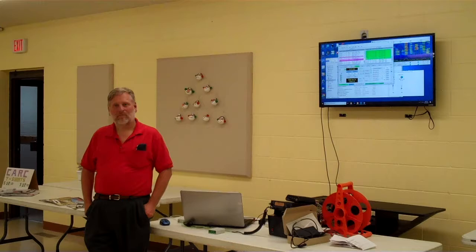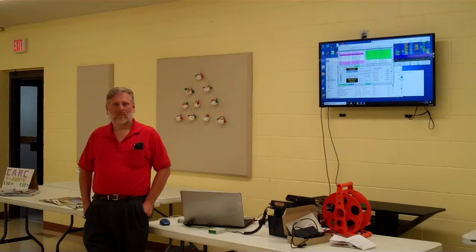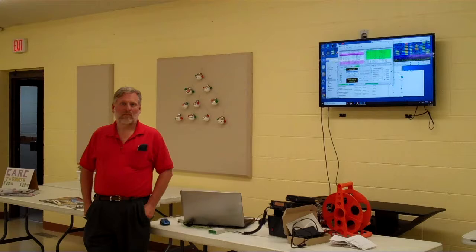So I have this, I forget who makes it, it's called the DSP9 Plus. It's an audio filter, basically. I started adjusting the cutoff for the top frequency, basically the low pass and the high pass, to try to narrow in to see where those tone ranges are. I tried to filter out some of that screaming in the audio, to see if I can improve the quality of the signal. And that got me thinking about this mode, because that did work: are there any special settings that help it decode, like filtering in the radio that's good to use, or do you recommend leaving it wide open and flat? Wide open is the best thing to do.